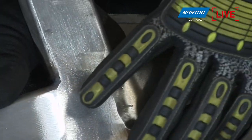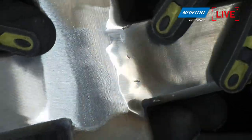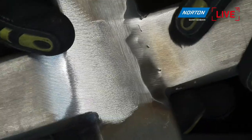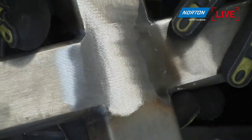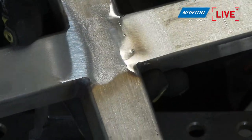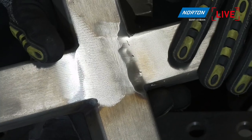Comparing the two stainless steel finishes: on the P36/P40 side, you can see what we call fish scaling — like fish bones on the surface, very obvious. On the P120 side, the scratch is much more refined. With the P120, the surface is pretty smooth and it will take a lot fewer finishing steps going forward, because we chose the right grit size for the weld removal application.